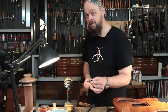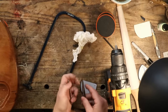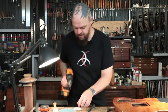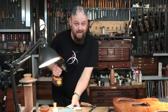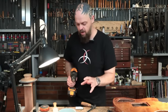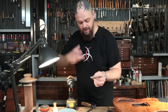The second the camera starts I have better ideas. So this is a budget reamer — you can get these on Amazon. That's about three millimeter on the end. I'm going to run some tests in the broken piece first and see what happens. I've got just a standard three millimeter drill bit, and as long as you push the Perspex down against something flat, or clamp it, you can drill through without shattering it. I'm then going to ream it out to the correct width. Essentially it needs to be clamped against a piece of waste material so that as you tear through, it does not shatter.